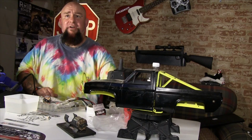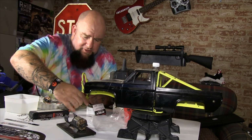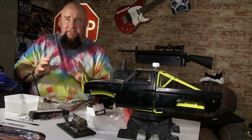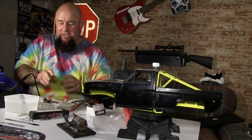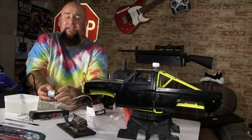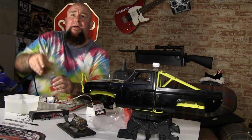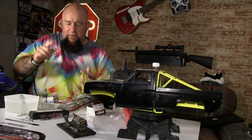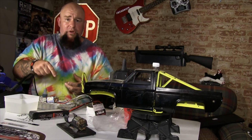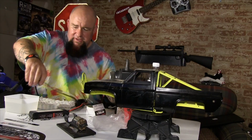So what I'm going to do is go ahead and turn my radio on, plug in. And also, when you're getting ready to do this, be sure you keep, this motor here specifically has bearings at each end. It's got one in each end of the end bells. I just keep bearing oil handy while I'm doing this. That way when I break it in, after I pull it out of the water and I'm done, I can re-oil the bearings so they don't rust up, they don't seize and such.